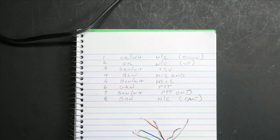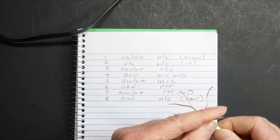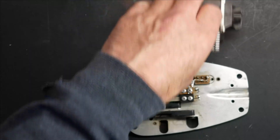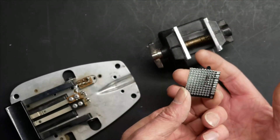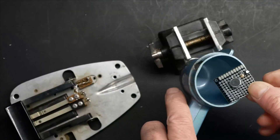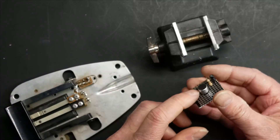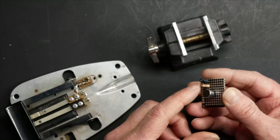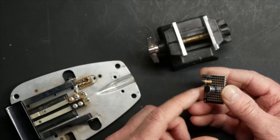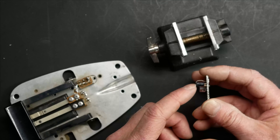Green-white is the third pin down, which is going to be 5 volts coming out of the radio. Blue is mic ground, and blue-white is mic audio. I've made a little circuit board with a few components on it — it's a generic universal circuit board trimmed to size so it fits inside the head of the mic. I've soldered our condenser mic element and a 10K ohm resistor, which will be our bias power. The 5 volts hooks to this, and coming out of the 10K resistor it powers up the mic element.